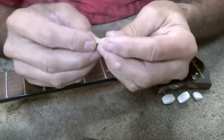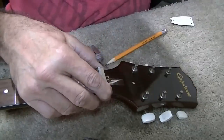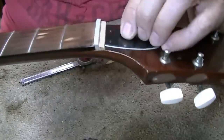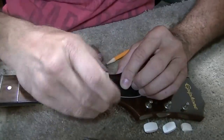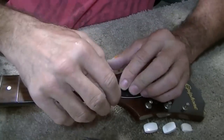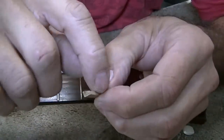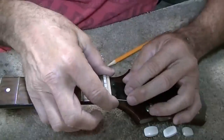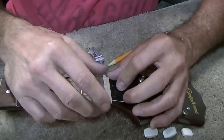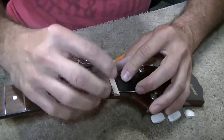I found a piece of mahogany and measured carefully between the nut and where the cover goes, and I made a piece of wood that fills that spot just perfectly. I marked the ends and cut it, and I also tapered the board slightly — it's actually wider back here against the nut and then it tapers thinner down against the trim piece, which is easy to do. It only takes a second or two with my sanders, so it wasn't a lot of work at all. Now I'm just going to glue that in place and stain it dark and see what that looks like.